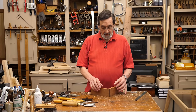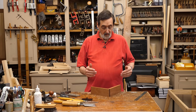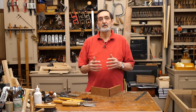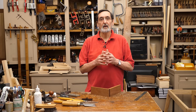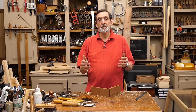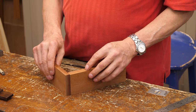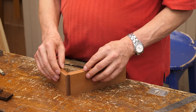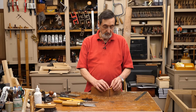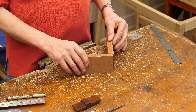I'm going to show you how to make a half lap dovetail. A half lap dovetail is a dovetail where the front face of a drawer is usually where we use it — you don't see the dovetail going all the way through like on a common dovetail where the tails and pins go all the way through to the outside faces. The side piece usually is dovetailed but the front has a lip along the front edge that prevents you from seeing it when the drawer is closed.